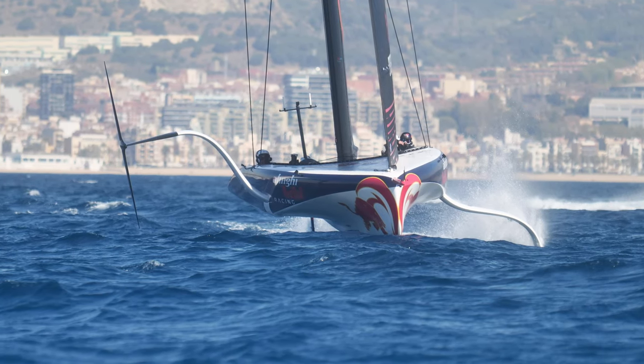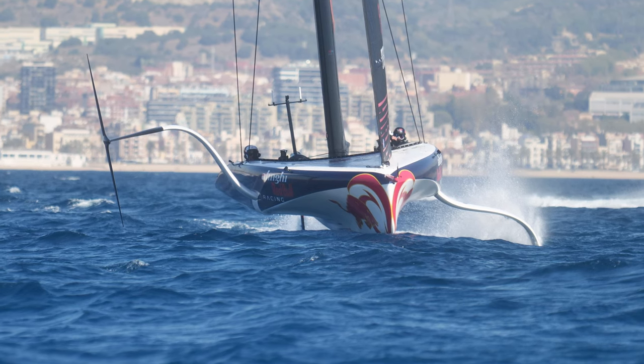And then they can flip it round and put it on the other side of the boat and compare that to how the plainer, straight leading edge copes in that environment and get a straight comparison between the two, but only at the cost of building one foil. Yeah, really interesting points, and some new ideas that Alinghi have brought to this game, certainly showing their value as a challenger, bringing new design ideas to the table. And it's exciting always to see new ideas displayed in the America's Cup, because ultimately that's what it's a test of: ideas and realizing them through engineering.